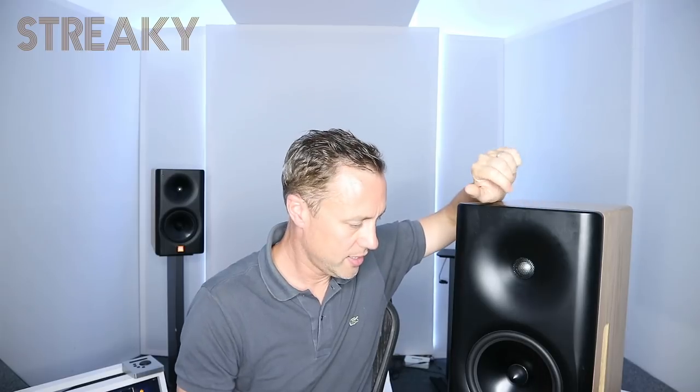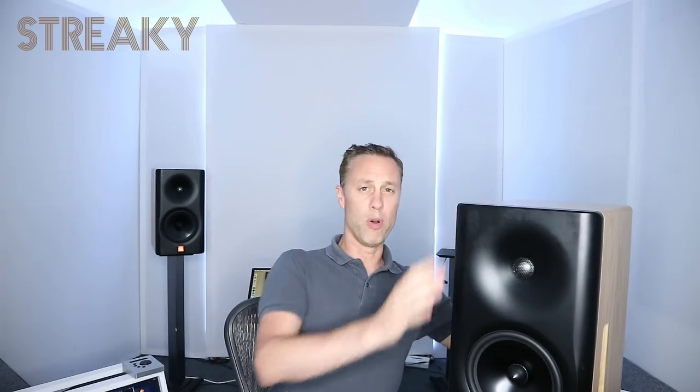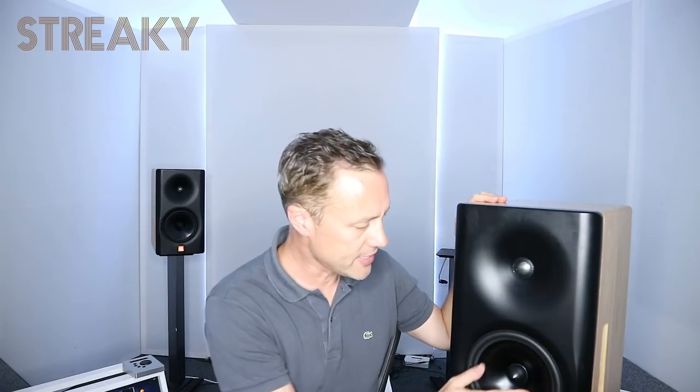It's not because they're a laid-back speaker — they are an amazing speaker. They are called the 8C. The 8 stands for the 8-inch subwoofers on the rear, and the C stands for cardioid. Now cardioid speakers are commonly heard about in live use. Subwoofers for live shows normally have cardioid-style subs to stop the bass from going miles back from the stage or even onto the stage — they use phase cancellation on the bass going backwards, making them more directional round the front.